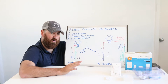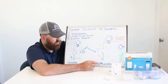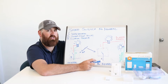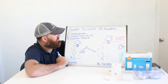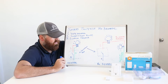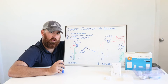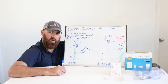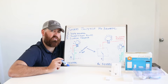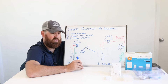There are some options for getting smart lighting if you don't have a neutral, which is very common on houses built before 1980. You could wire up a neutral, but what does that actually involve? That would mean finding where the neutral goes in the circuit and bringing a neutral wire into the box, which typically requires opening up walls, pulling cable, or pulling wire through conduit. That's very difficult and time consuming — you're probably going to end up patching and doing drywall. Unless you're in the middle of a major renovation, I would not recommend adding a neutral.